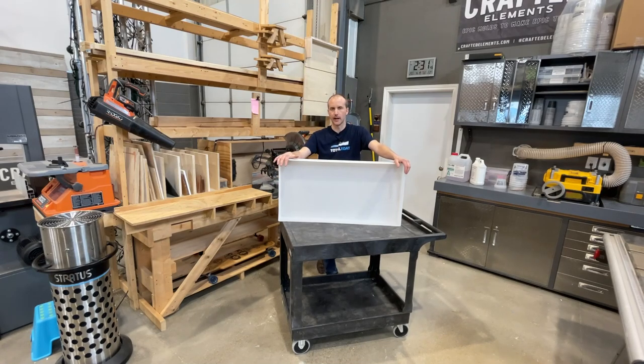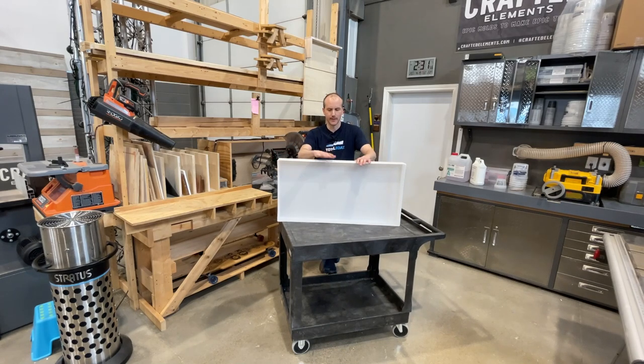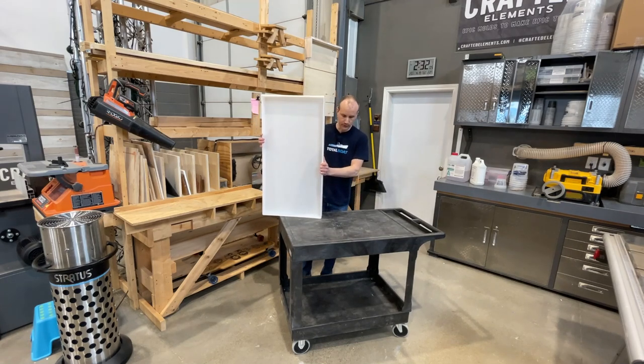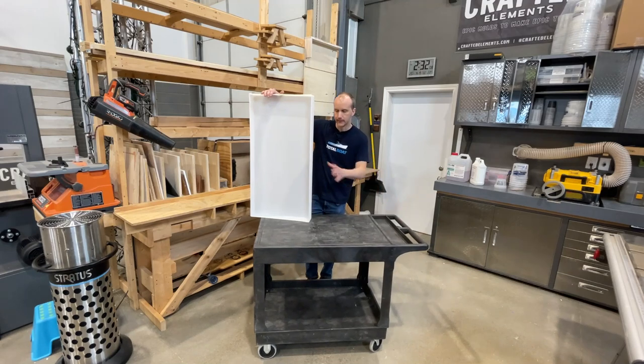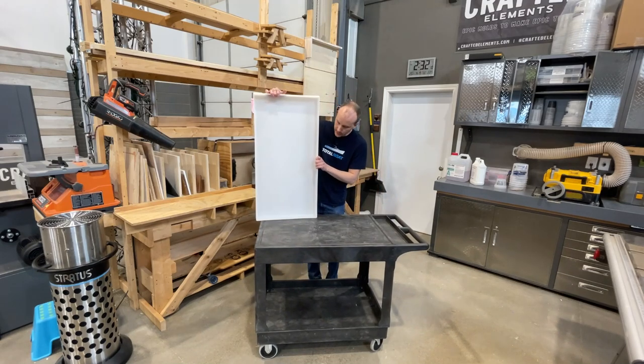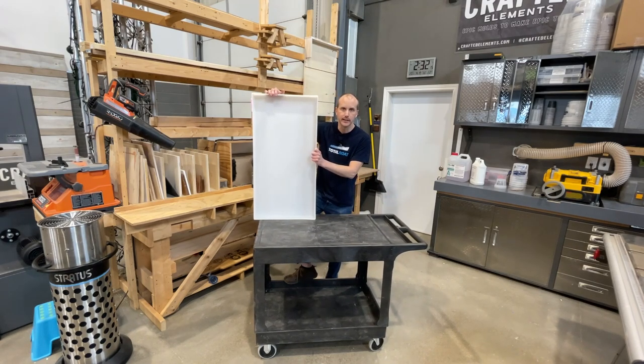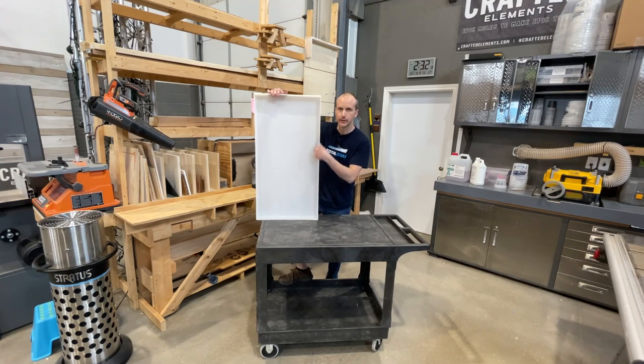We do have this size as well as a wider size in silicone, but they are much more expensive. Silicone molds, square inch per square inch, are notably more expensive than these vacuum-formed, thermo-formed, or rotational-molded HDPE molds. The advantage of using an HDPE mold like this is really cost, to be honest. This mold would be two to three times the price in silicone. This allows us to save money when making tables, and these perfectly-formed HDPE molds last a really long time.